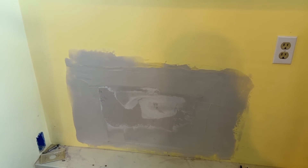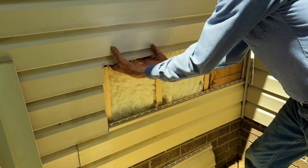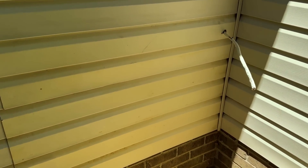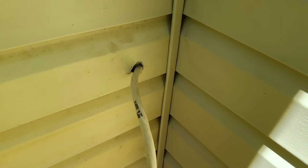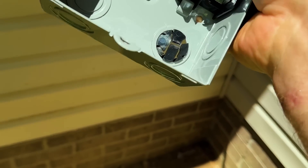As you can see, we have it out of our box here and we're going straight through — we'll show you what it looks like outside. I just got my first layer of hot mud on this, so we'll get that sanded, get a second layer on, and we should be golden there. Out here we have our siding patched — it's not a perfect match, but it looks pretty good. This is kind of a hidden little cove here, so it doesn't really matter. We have our wire pulled through, about to install our disconnect box, and we have this strain relief to keep that wire from rubbing against raw metal.